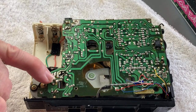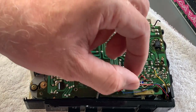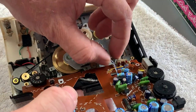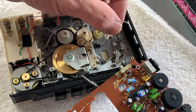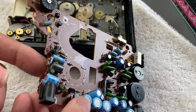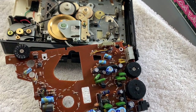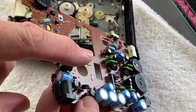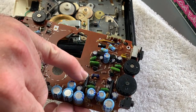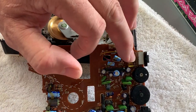So to recap: we've got the black and red from here, the red and blue, the orange and red, the black one from the top, and we've also taken the blue and white cables from the leaf switch. With that done we can actually open it right out and see what's what. You should see the chips - I think it's a 3160, yeah the 3160 preamp chip there, and then the 4140 power amp. You've got a separate left and right power amp for your headphones, lovely.